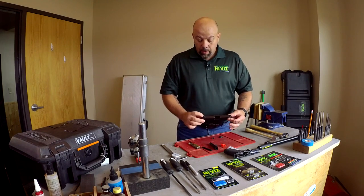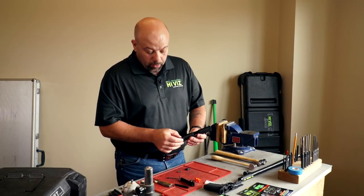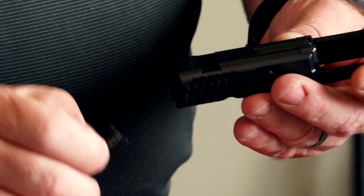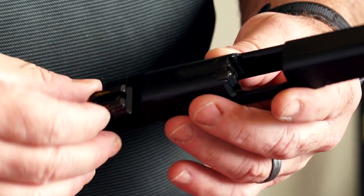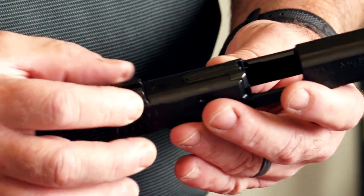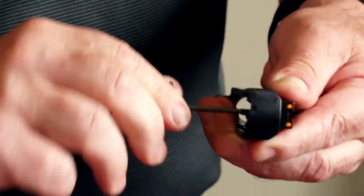This particular gun, the rear sight is only held in place with a screw that you access from the underside of the slide. We remove it and we'll reuse that screw for the replacement sight. The rear sight on this particular model is a slip fit because it has a screw that retains the sight, so our H3 will slide right in place freely and we will replace the screw on the underside of the slide.